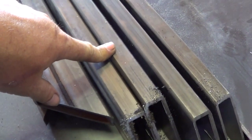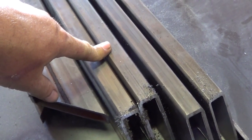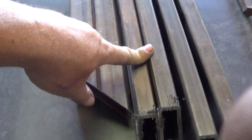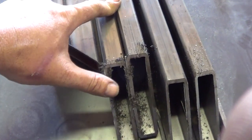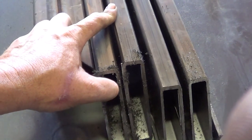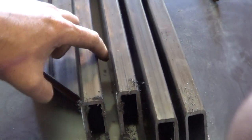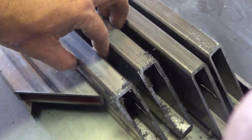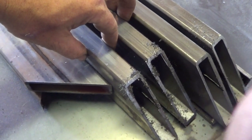The door frame itself is a massively overbuilt structure, but it's holding, like I may have mentioned before, a 200 pound piece of glass, or a 300 pound piece of glass, is what I'm told. It's basically these two frames here, and then they get a 5/8 inch spacer between them. So this door is going to be 2 5/8 inches thick. It's a big, heavy, heavy, heavy door.